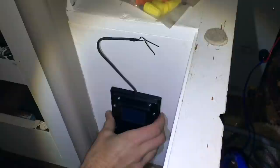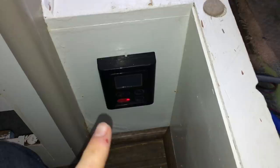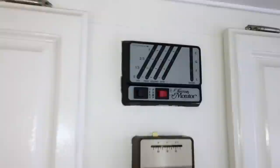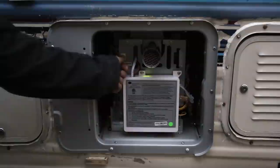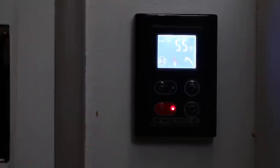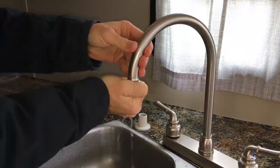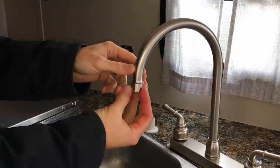The next thing I needed to do was remove the face plate on the user control panel so I could attach it underneath the bed near the hot water heater. I screwed a hole through the wall and mounted it close to the hot water heater, then wired the two black lines from the user control panel to the two blue lines coming out of the back of the hot water heater. The last step was turning on the water pump and the LPG lines to check for leaks. Finding none, I reconnected the 12-volt power to the fuse box and powered on the unit. It immediately engaged when we turned on the hot water in the shower, but we found the half-gallon-per-minute aerator on the kitchen faucet doesn't allow enough flow to trigger the heater — removing it and replacing with the original aerator fixed that.